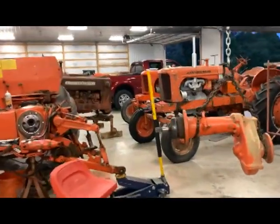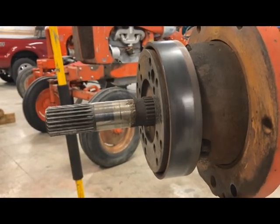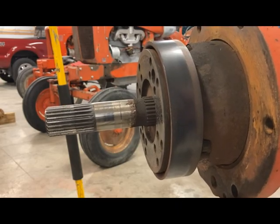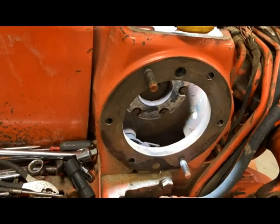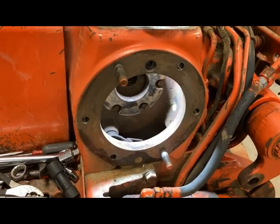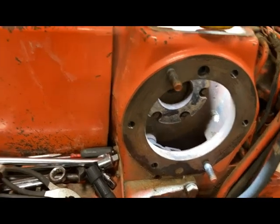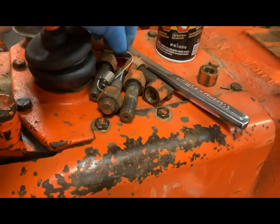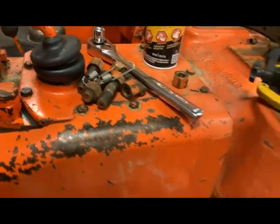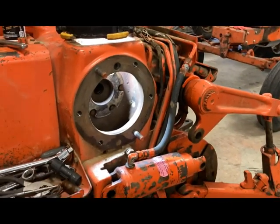At this point we're almost ready to assemble this beast, but we've got to install our brake shoes — we've got our rear and front shoe that we've got to get in place and get ready for the drum assembly to slide together. We're going to replace our springs; I've got brand new springs that came in the brake kit. We'll replace both of those, get that assembly in there, and then we can slot our axle back into the rear end.